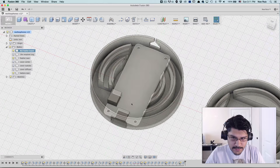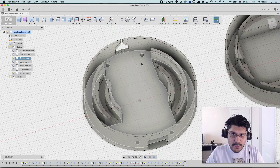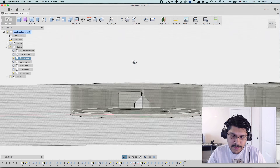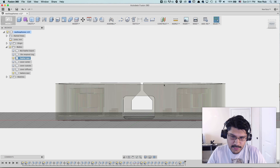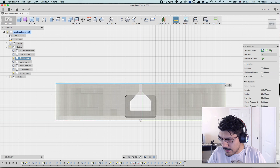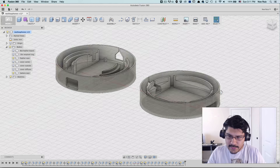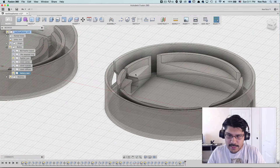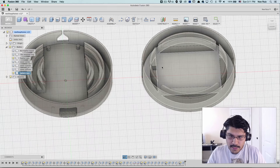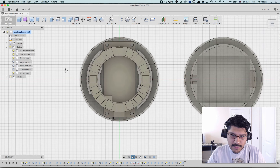Interestingly, there are no mounting screws — just pegs. The bottom of the board is so flat that I didn't need any actual standoffs, just pegs to hold them in place. That's what makes the thing really, really thin. Let me do a quick measurement — it is 11.5 millimeters thick, so it's really thin. There are actually two different cases: one for the board and the ring, and another for the battery and the switch, which goes in this opening. And then the actual ring snaps in here. We'll show you how to model those things.